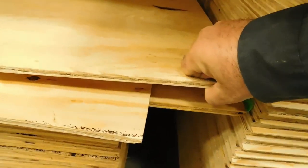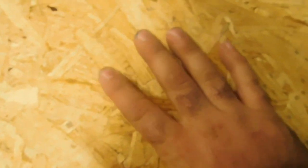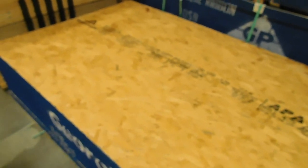All right, now when you're looking for plywood, what I would suggest staying away from is the particle wood, the wood made out of the chips. Yeah, it looks like that on the outside. Stay away from this crap, that's indoor. And then this is too thin. You want a thick board, thick like this. So we want to stay away from this crap, because when it gets wet, it's just gonna peel apart and it's not even gonna last. It won't last into your second season.